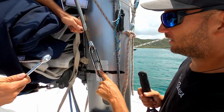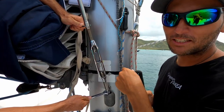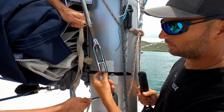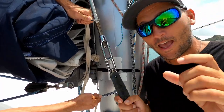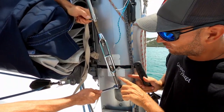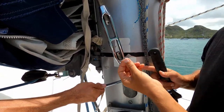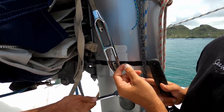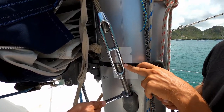I was a little bit efficient and pulled the split pins - cotter pins, whatever country you come from, those little metal things that stop it rotating. You would have seen in a previous video where we did my rig that I like to use nuts and bolts in here instead - it's just a lot neater. We've also got a little bit of lubrication on these threads. The previous rigger was good in that they lubricated - it felt like a lanolin-style grease, quite thick and sticky. If you haven't got that, Tefgel is another good one. Any grease or oil on the threads works.